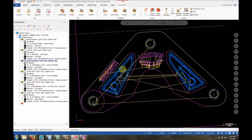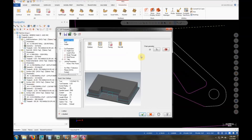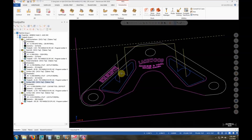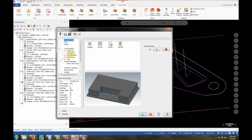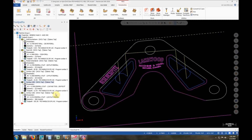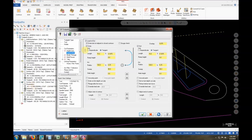At the end I clean up the corners with a quarter inch end mill to make sure everything's nice and tight in there — this dimension is exactly 3/8 so it doesn't always like to get right into that corner. After that, I'm using a 1/16th rad tool to do the insides. If I turn everything off you can see it — it has a quarter inch pilot going into a nice open spot. I have a 75 thou overlap on the lead in/lead out just to make sure there's no little nib where it touches.